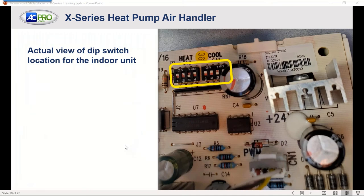Here are the dip switches: SA-2 on the left-hand side is for your heating setup, SA-1 on the right-hand side is for your cooling setup. Always make sure you have a good duct system — if we don't, we're not giving the customer what they're paying for or meeting their expectations.